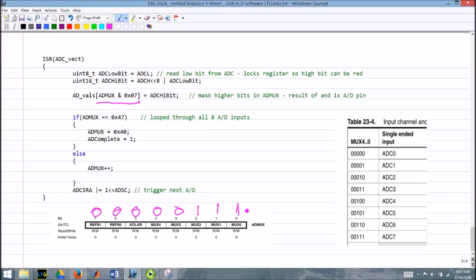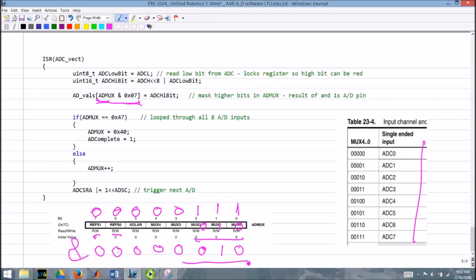So when I do an AND with ADMUX and 7 hex, I get the results here. That's supposed to be an AND sign. Let me try that again. There we go. The results of my AND: whatever this bit is, doesn't matter, we get a 0. Whatever this bit is, doesn't matter, because we got a 0. We got a 0, we got a 0, we got a 0. And these three bits here will get either 0 or 1, depending upon whether these are 0s or 1s. Okay? And that essentially is our channel number from here. So the net result here is just the channel number with all the other bits being ignored.